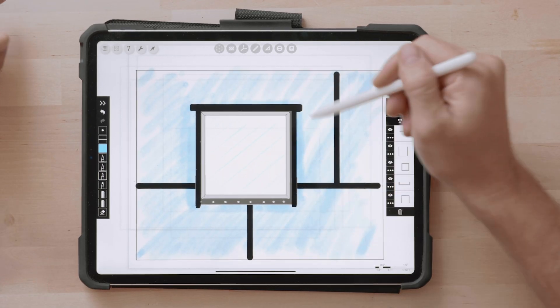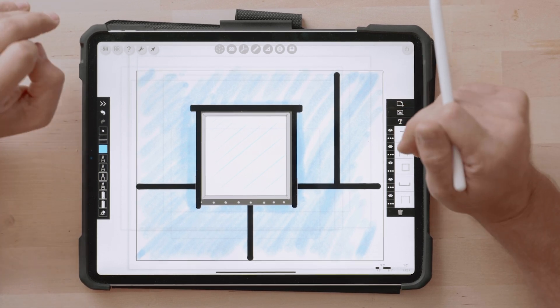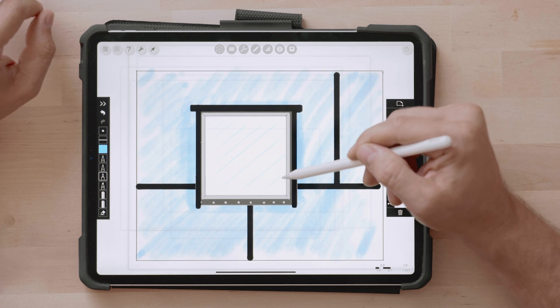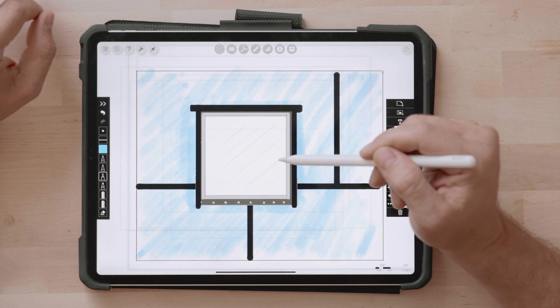If you want, you can use some sort of shim system — horseshoe shims are a great way of pushing that bottom flange out just a little bit, maybe a sixteenth of an inch, to let any water that gets back there out. So now you have a properly installed and waterproofed window, because any water that comes down is pushed outside and drips off the front.